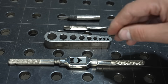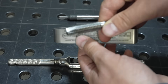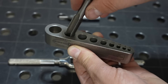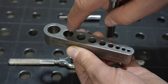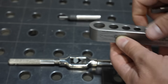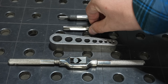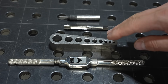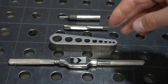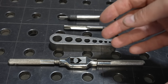Let's talk about how to keep your threads nice and straight, because if you're going through a hole at an angle, as you thread in, it's going to start to jam because it'll need to cut too much material off one side while missing the other. So it needs to be really straight. The best way to do this is to use some sort of a guide. In thinner material you can usually eyeball it, but the thicker you go, the more important using a guide is. A guide you might already have in your shop is a drill press — this applies on a mill too.